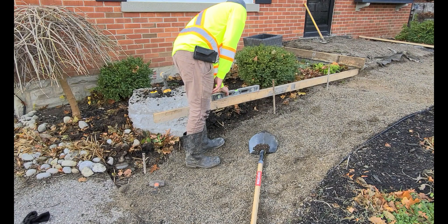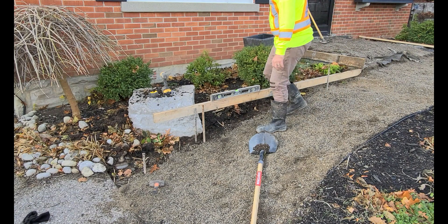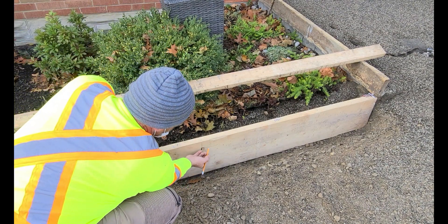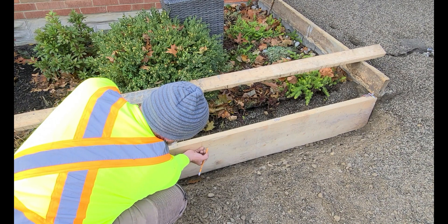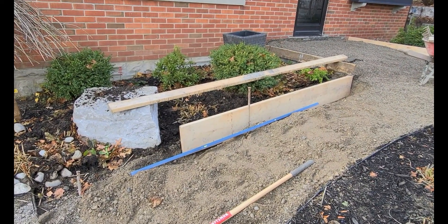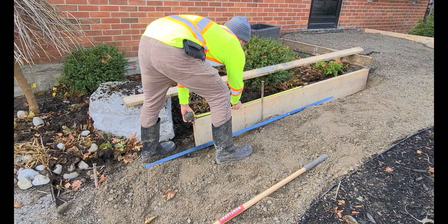What I'm doing is checking to make sure this two-by-four is level, then figuring out how far down I have to drop the steps and how much slope I require per square foot. I've got my first inside step form in, attached to the porch area, and essentially I've just marked the area where the first step is going to go, plumbed and leveled it, and made sure I know where these steps are going to line up.